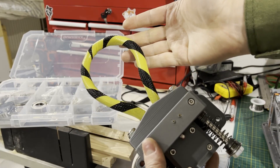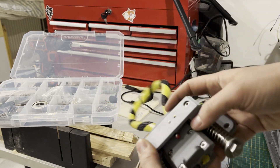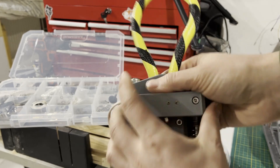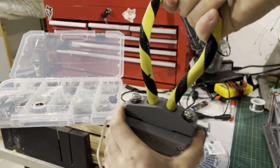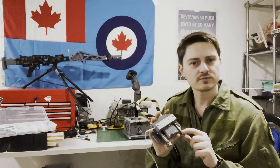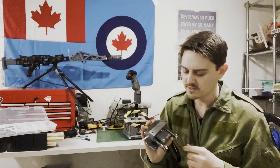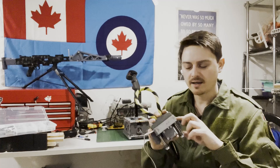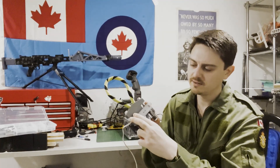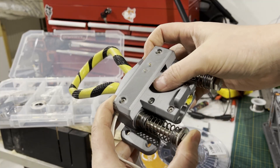This cable is actually very easy to make — it's just a cable sleeve that has yellow electrical tape wrapped around it. It's an ethernet cable that I cut and then clamped between these two pieces of 3D printed parts, and that's what makes the handle. The way it works is it has two springs from RC shocks — 110 millimeters — but you can substitute other springs. It has 8 millimeter magnets inserted here, and you pull it up. As you pull it up, it clicks a little micro switch on a roller in there, and that's what activates it.